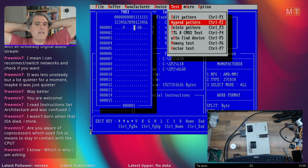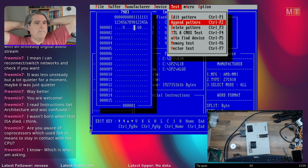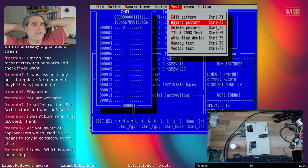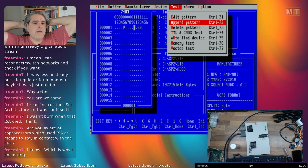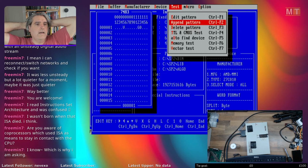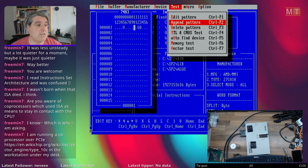I think if it's going to be an 8087 or 287, 387 equivalent maths coprocessor, I think it's unlikely, because I think the interrupt signal that it uses isn't provided on the ISA bus. So you would have to have some extra connection coming from the card to somewhere else on the motherboard to pick up that signal. So I think it's unlikely. But I mean, there's absolutely no reason why you couldn't have an ISA card with some other processor on it for doing a specific job, but...